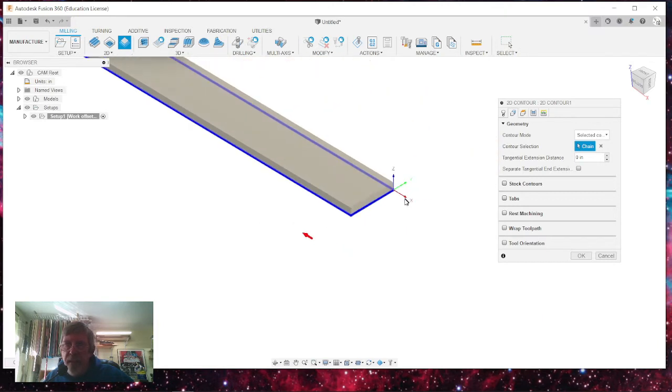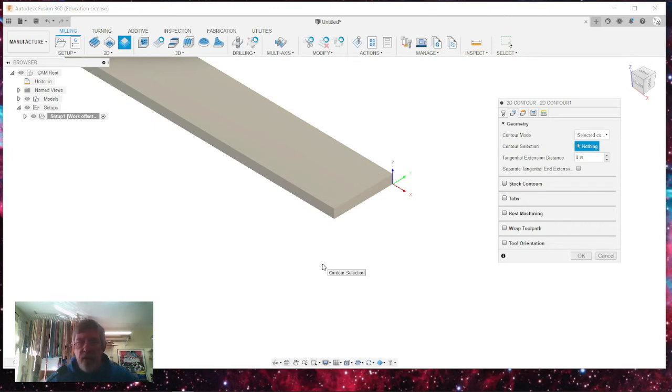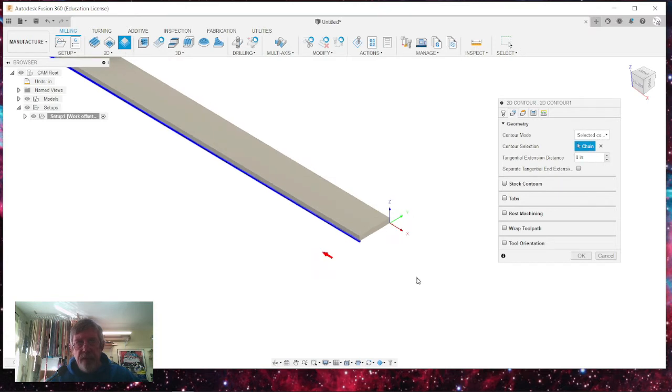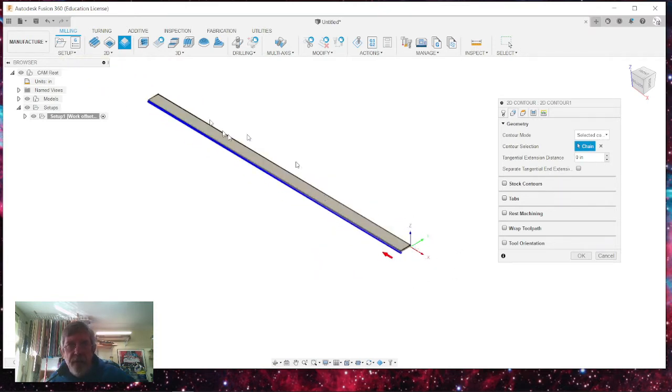And this is something in Fusion 360 that you first have to select the whole face, the whole edge that you're going to do, and then delete it, and then hold the alternate key down and select just this one edge. This allows me to put my dowel or my material, my rough stock, in my CNC machine along the x-axis and turn it on and have it spinning and just run down this face.